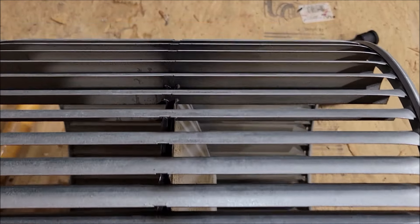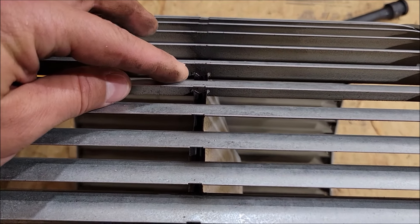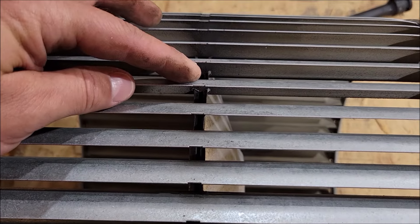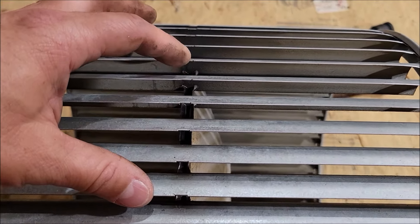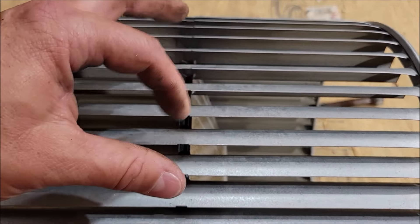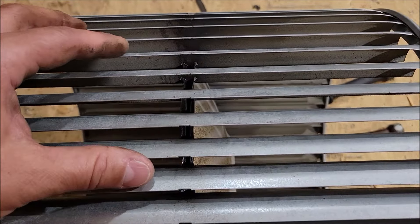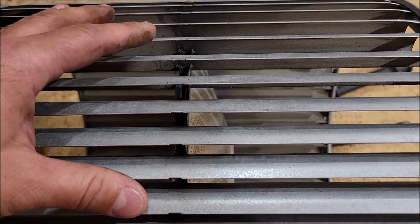I tightened the vice grips all the way and just went in here clamping every third one. Instead of pushing that metal out each direction, it pulled it in in the middle - which either direction looks fine, because when you pull it in it's now hitting that little V shape going in. Either way you're really just trying to make sure the metal in the middle touches that fan blade evenly all the way around, so there's force on all of these fans. You don't want to just do one or two because then you're putting all that spin force against just one or two blades - you want to evenly do it all the way around, like putting lug nuts on your car. I was even trying to do one side then the other to keep it in balance, because you don't want that middle plate leaning one direction. That seems to be holding really well - I put a little force on it and I can't spin it by hand, so I'm hoping that's going to be enough.